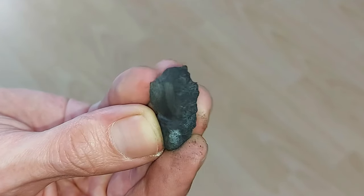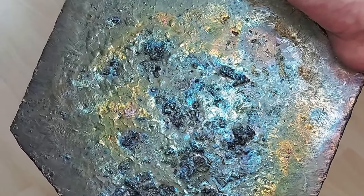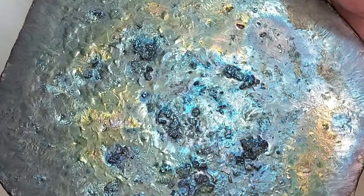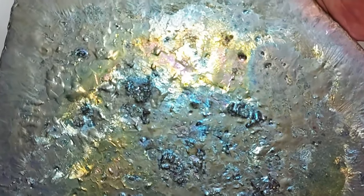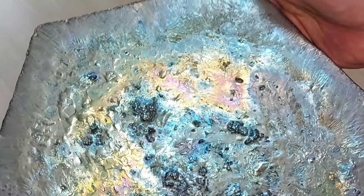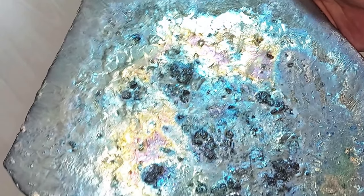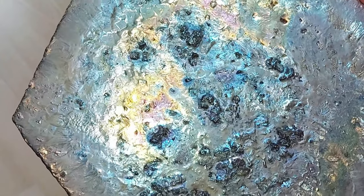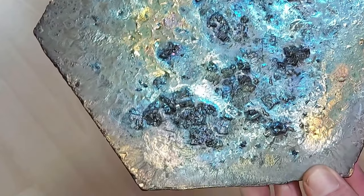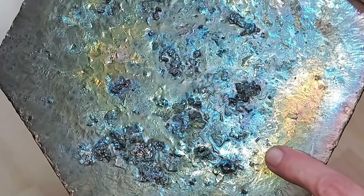In the second part of this video we will be discussing bismuth oxide. What you see here is a bismuth tile I poured in the past. The colors you see reach from yellow-gold over green down to deep blue hues. These colors represent a thin layer of bismuth oxide on the top of the cooled-down bismuth surface, and the color indicates the thickness of that layer.